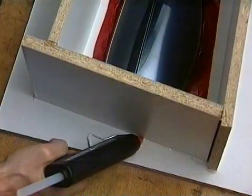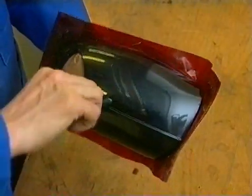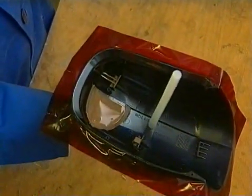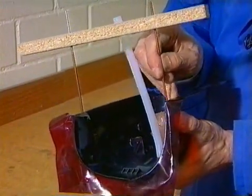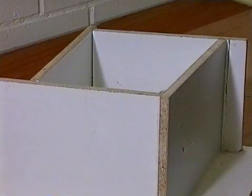In a second step, the gates and risers are adjusted. Small and lightweight parts can be suspended at the riser alone, while a solid three point suspension is recommended for bigger parts. A two millimeter diameter hole is drilled through those parts that are highest during the subsequent casting process so that a steel wire can be fixed here using super glue.